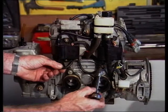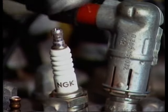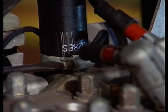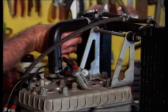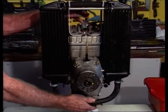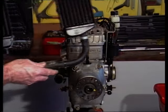We'd then be looking at taking the ignition packs off - they're mounted on the engine via a backing plate, with high tension cables to the spark plugs. The cooling system on this particular model features engine-attached radiators. We have twin radiators with upper mounting brackets - four or five nuts and the whole assembly comes away rather quickly. That leaves the engine as an open book, stripped bare, with all the accessories basically removed. We just have cylinder head, cylinders and this style of thing still to come off.